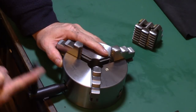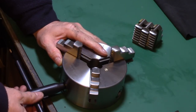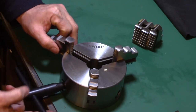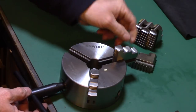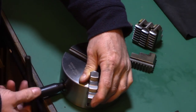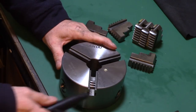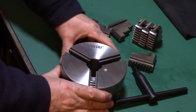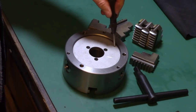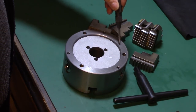Although a little rough sounding, the jaws moved quite freely within the chuck and it could have been used straight out of the box. But I wanted to disassemble the chuck for further inspection and cleaning prior to first use, as quality control issues are often overlooked at the factory due to high volume manufacturing and time-consuming quality inspections. I centre dotted the back plate and the chuck to give me a reference for reassembly and proceeded to open the chuck.